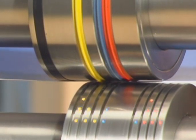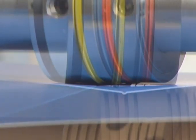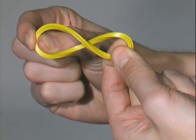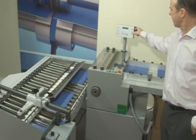The Tri-Creaser EasyFit gently stretches and manipulates the stock without damaging it. The gripper crease penetrates the stock and gently pushes it into the channel sitting below it. The gripper crease is a stronger and more durable compound that outperforms the previous type of creasing insert by over 50%, ensuring a lifespan of at least one million impressions before replacement is considered.